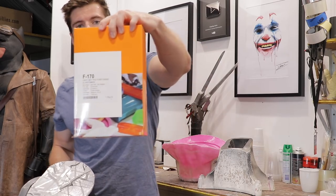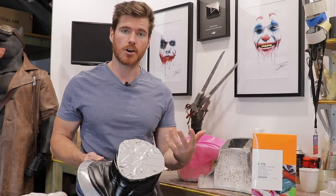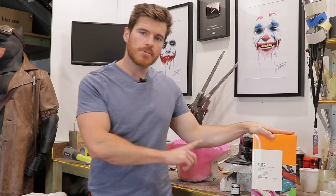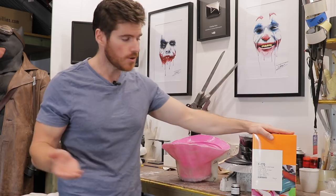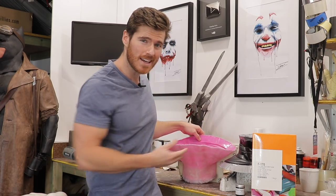For the flexible urethane casting we're using F170, a fast set urethane from Barnes. With urethane for flexible castings, you really have to keep working with it — you can't just slush it about like a rigid resin and leave the coat to dry. You have to keep working with it until it gels and sets properly. The mix ratio for F170 is 50 to 100, not the usual 1-to-1. It dries a honeycomb color, so you only need a little black tint — it goes a long way. Ideally I'd like to do three or four slush coats, working the urethane around in the mold with a gloved hand until it starts to gel, because urethane tends to bead away against silicone much like water on skin.